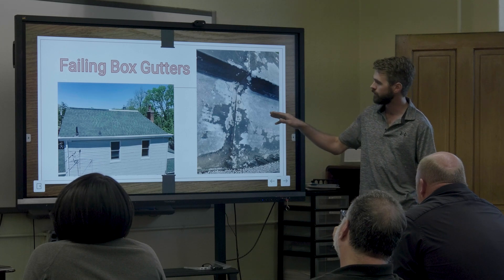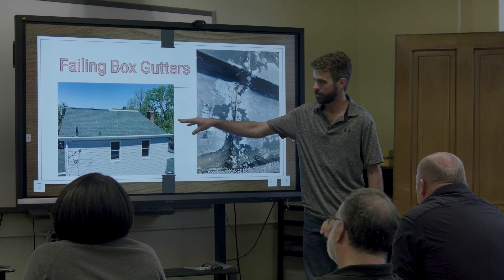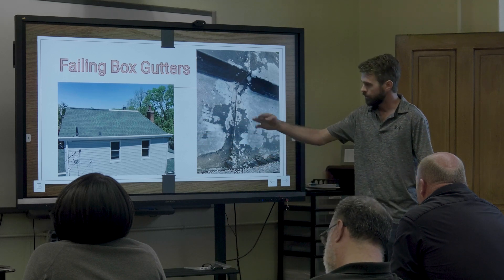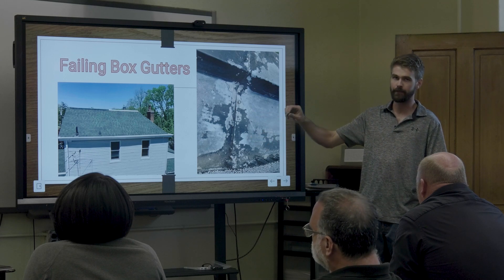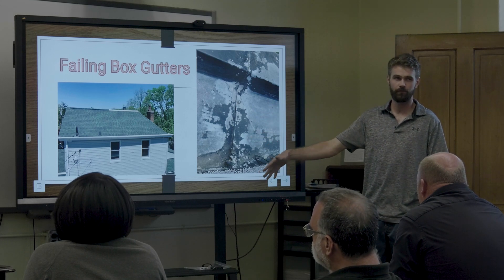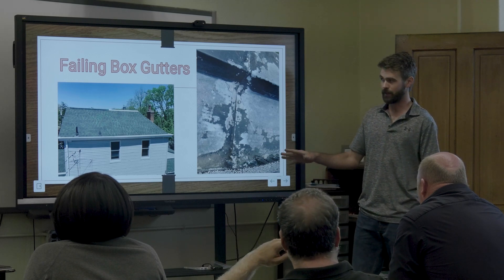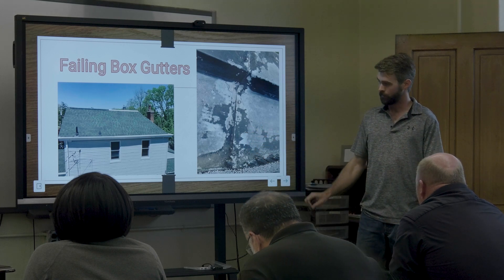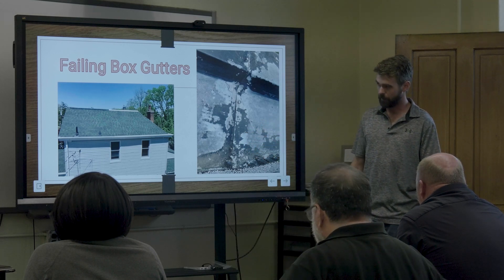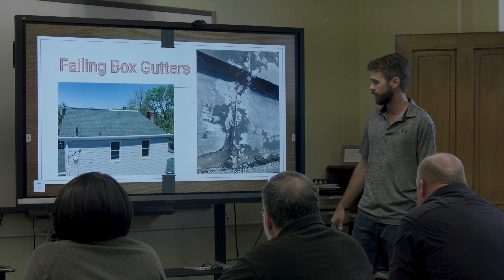This was a separate roof that had an EPDM rubber liner. Usually those will be fascia-wrapped EPDM — that's a good old-fashioned flip-and-fix type thing. Somebody's not going to put the money into fixing it right. You've got to be careful about contractors that put shiny new metal over rotten, sagging wood — it looks great at installation, but the problem's still there.